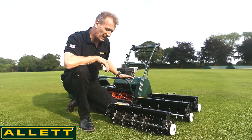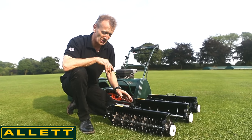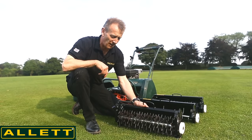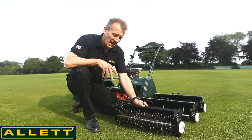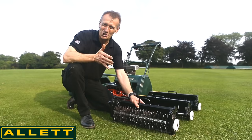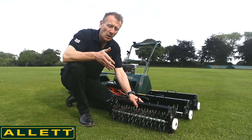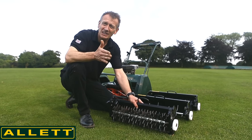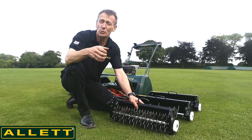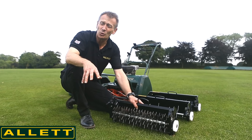What we're able to do with this mower is take the cartridge out of the machine and insert different cartridges. This is my verticut cartridge — it rotates powered by the engine, and you can see the blades resemble sword blades. What the verticut cartridge does is vertically cut, as the name suggests, down into the sward and into the thatch layer. What it's able to do is remove thatch while also cutting the rhizomes and stolons to encourage new growth — much the same way you might prune a bush and see new growth sprout from where you cut.